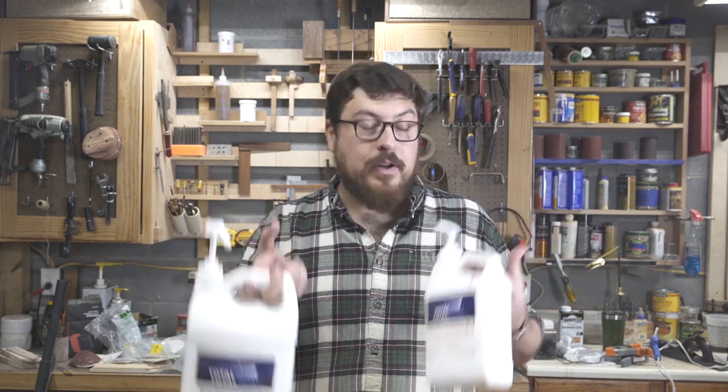And so I use a 2-to-1 epoxy in my shop frequently. Before TotalBoat came onto the market, I had been using West Systems epoxy, and that had been working great. One big gripe that I had with West Systems is that it wasn't clear. It was amber, and very amber at that. It even says on the back of the can that it will get more amber with age. It will darken with age. It will still be as strong. But for me, because I'm not using it just to bond things, the epoxy would actually be seen. And a lot of the times, I wasn't crazy about that.